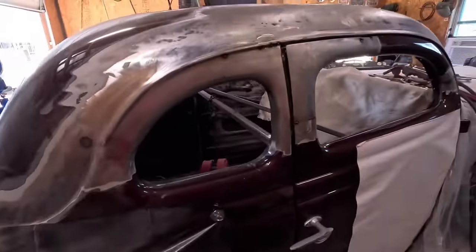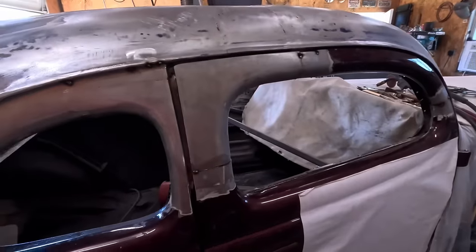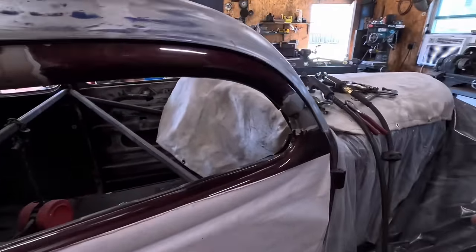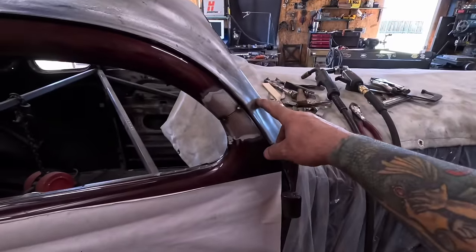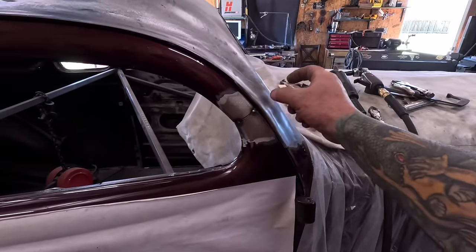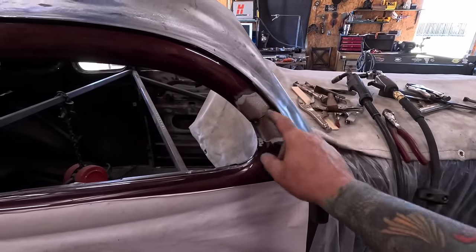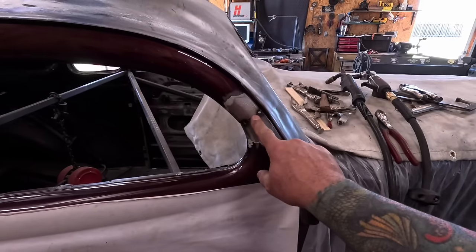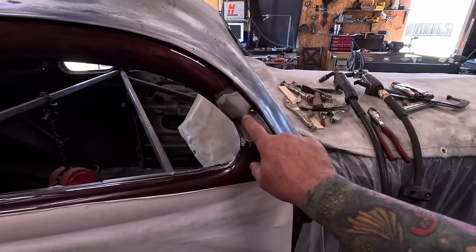See if I can actually accomplish something today. It's gorgeous outside so I got the lazies. Still whittling away on the doors - let me show you. This is where we're at. I got the doors pieced together here. Now we took three inches out of the pillar here - that doesn't necessarily correspond to three inches on the door because it kind of comes in. This was actually two and about seven-eighths removed from here.